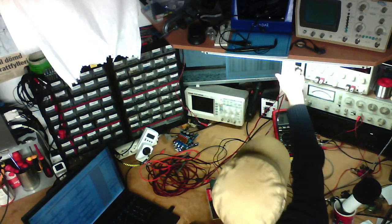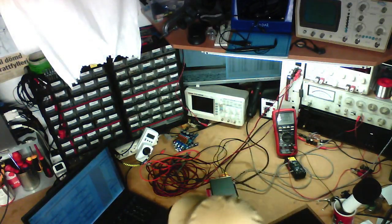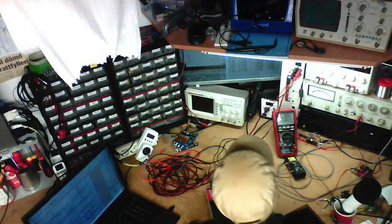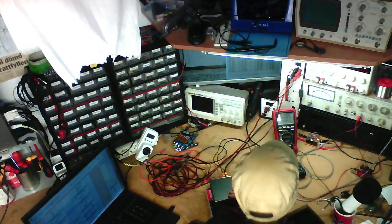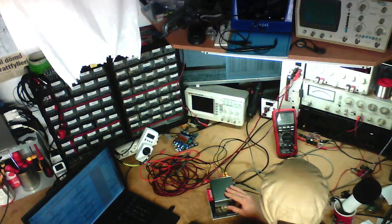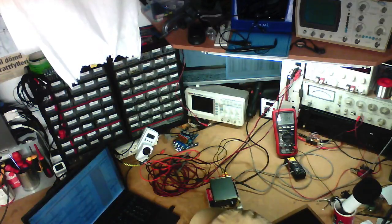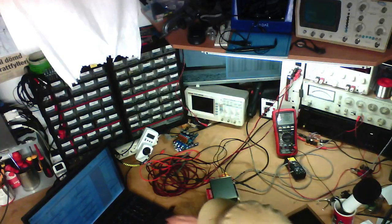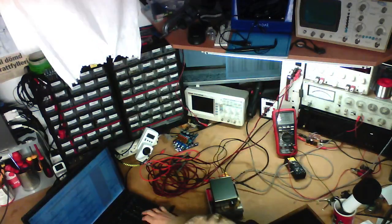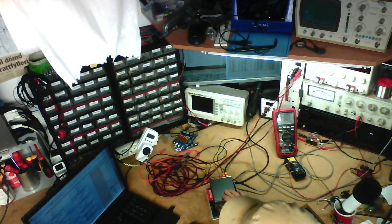Right, so the impedance test for 4 ohms. I'm going to put the load at 4 ohms and take that out of differential measurement. We want half power at 4 ohms, which is about 16 watts per channel, something like that, which is the same as 8 volts. Left channel. Eight volts, thereabout, 7.985. Well, let's just do 7.98. Differential mode, load off, 0.514 volts. And that gives us an output impedance of 0.275 ohms, or a damping factor of 15.